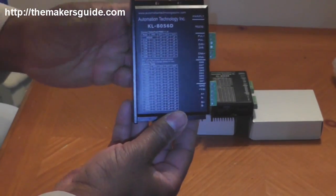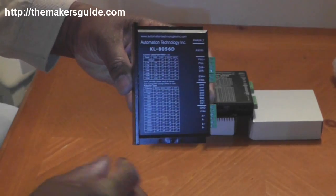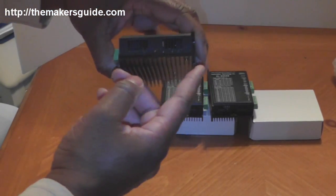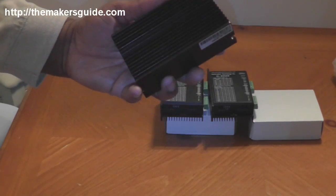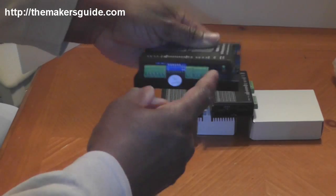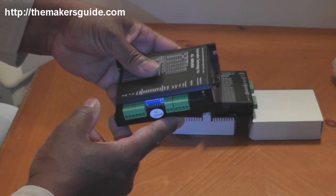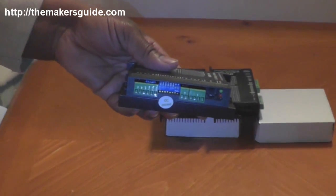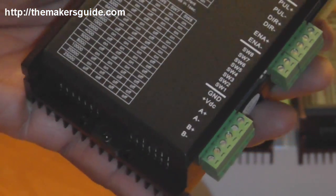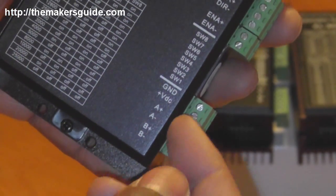I didn't get a good look at these drivers before. They've got an aluminum or metal case on the outside, with an aluminum mounting bracket on the side with slots for screw heads. I didn't notice this the first time — there's a built-in heat sink on that to keep these cool, which is pretty nice. You can see it's got an RS-232 port on the side, lights to indicate whether there's power or something's wrong — red and green. There are dip switches on the front so you can set different configurations based on the charts silkscreened right onto the front. Ground and DC are clearly labeled, and these are the different motor phases and stepping directions.